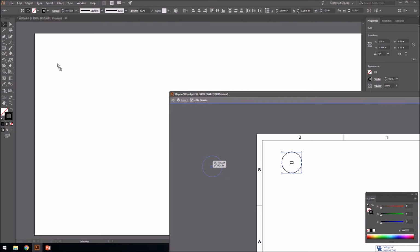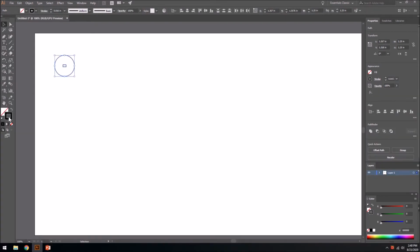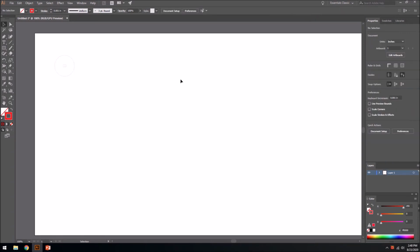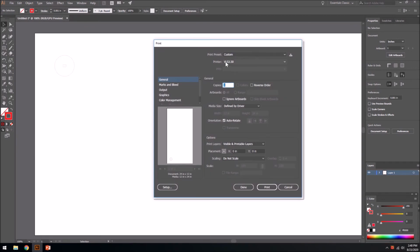And what that allows us to do is allows us to change the colors on the PDF to where we can then send them to the laser and make that work. We're going to be using like red, and it's got to be the FF0000 red, because that's what the laser recognizes as a cutting vector. And also it must be 0.001 as far as the thickness of it. Once we have that done and we've got all of our lines established that way, we can then go in, send it to print, confirm that it's sending to the laser, which is the VLS 3.5.